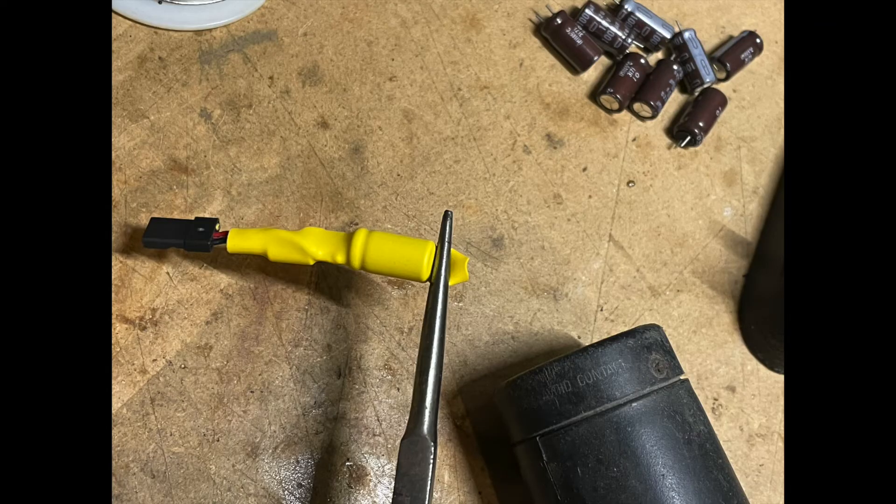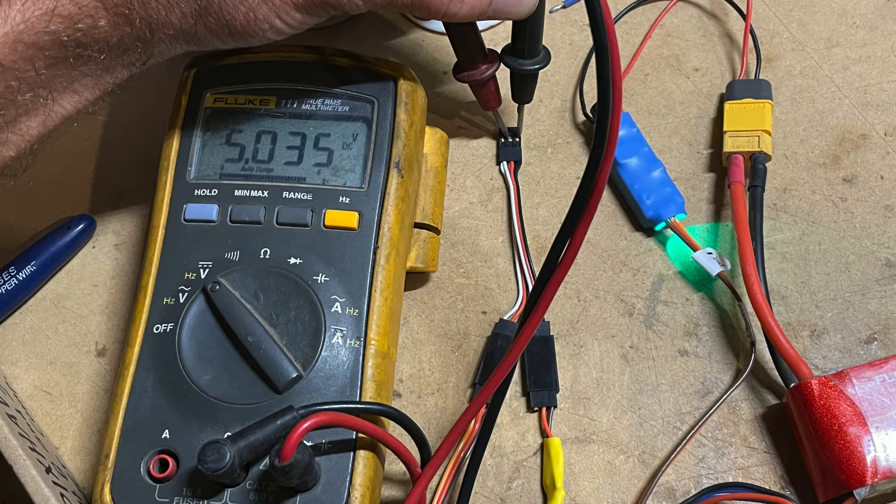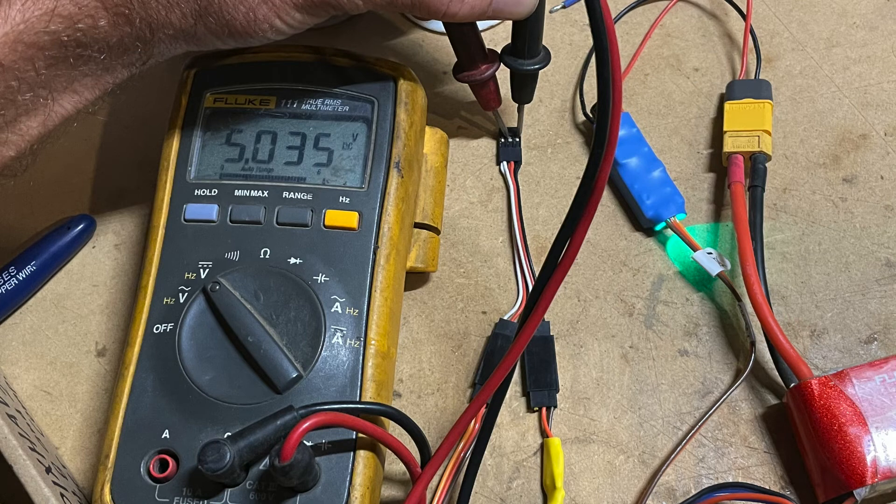Now you can cover it with a piece of heat shrink. You can test it to make sure it's safe before plugging it into the Pixhawk by using a BEC set to 5 volts. The Castle 10-amp BEC comes from the factory set perfectly for this job. Nevertheless, double-check it with a voltmeter if you have one. Use safety goggles, because if the polarity of the capacitor is backwards, it will explode with a loud pop. You can use a servo Y connector as a tool to easily connect the BEC to the filter you just made, and also have a convenient way to measure voltage with a digital multimeter at the same time. You should measure exactly 5 volts within 1 tenth of a volt. In this case, the stock Castle 10-amp BEC is within 3 one-hundredths of a volt — a near-perfect result.